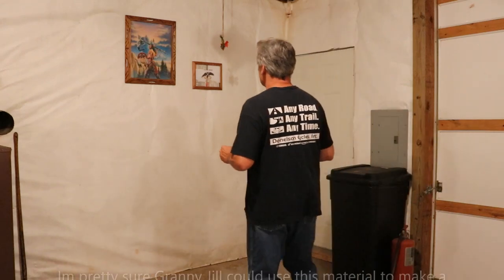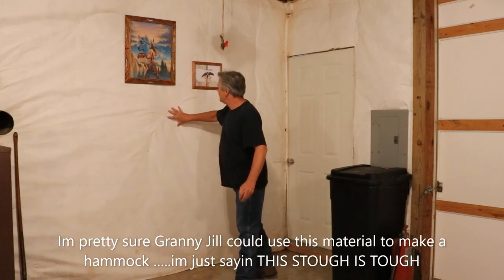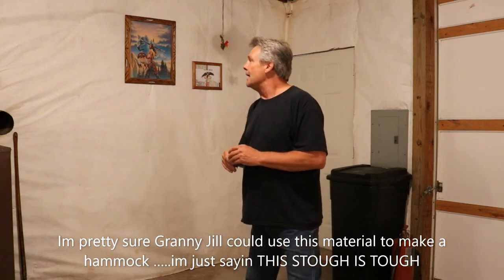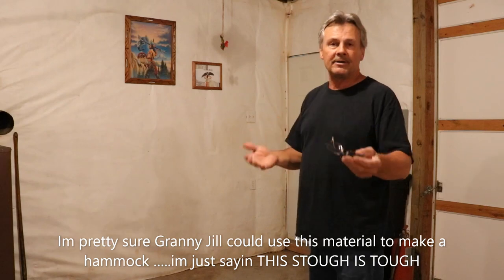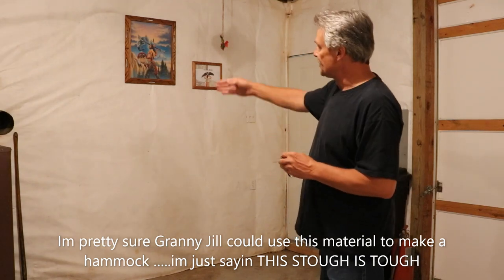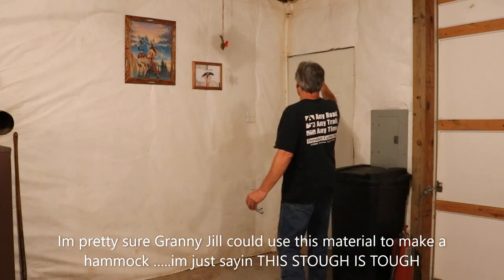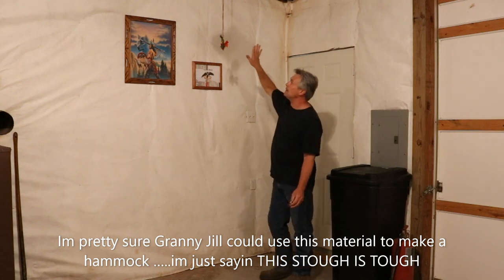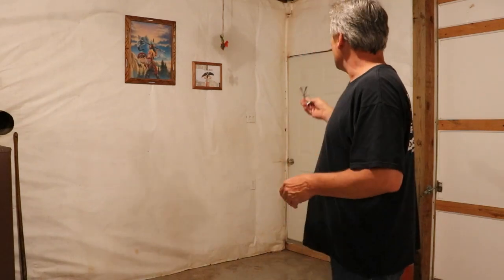We used Tyvek as a conscious decision for sound deadening. This is an extremely durable material — this has been standing for 20 years. It's a great way to cover up the walls and help with sound. We simply stapled it onto the wall, started in the corner, and it comes in ten-foot rolls. We kept it square and just rolled it down through the building. It was absolutely simple to install. When you come to a light fixture or outlet, simply trim around it with scissors and keep right on moving.